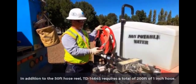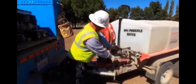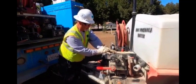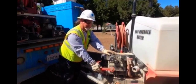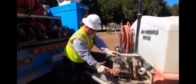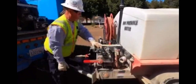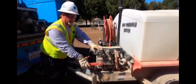You'd run this line out to the job site and put it in position. When I have this lever pointed forward, this allows me to actually fill this tank through the suction of this pump. So if I had a hard suction and I wanted to fill it from a static water source — like a creek, a reservoir, or maybe a folder tank that we have on scene — I would have a hard suction hose connected to one of these discharges and I could fill the tank through the plumbing on the tank.